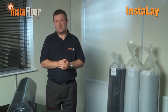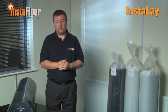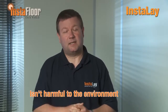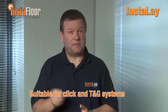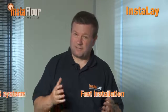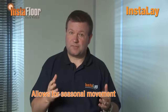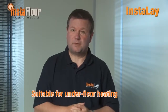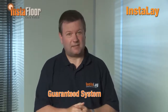As you've just seen, the InstaLay Peel and Stick System provides a fast, high-quality installation for all types of wood flooring. So why use it? InstaLay isn't harmful to the environment — it's made from tyres that may have otherwise ended up in a landfill. InstaLay has exceptional acoustic performance. It is suitable for click systems and tongue-and-groove boards, and provides a fast installation by avoiding messy adhesives or mechanical fixings. InstaLay allows for the seasonal movements of boards and reduces the effect of cumulative gapping. The underlay is porous, so it's suitable for use with underfloor heating systems. And you have peace of mind because the InstaLay system is guaranteed.